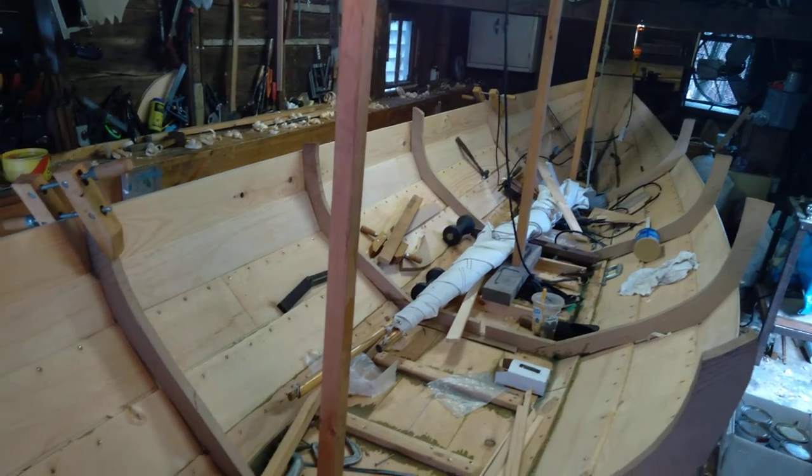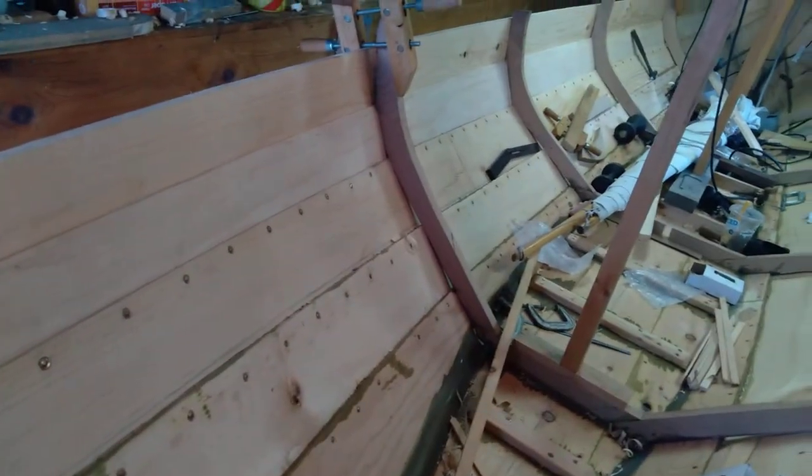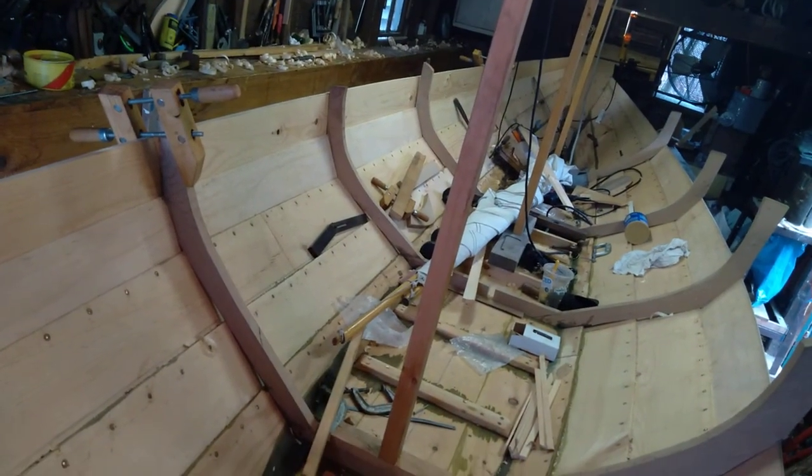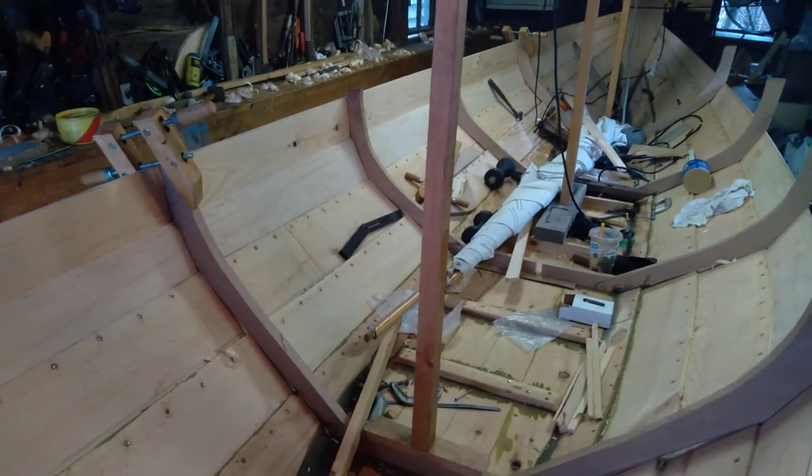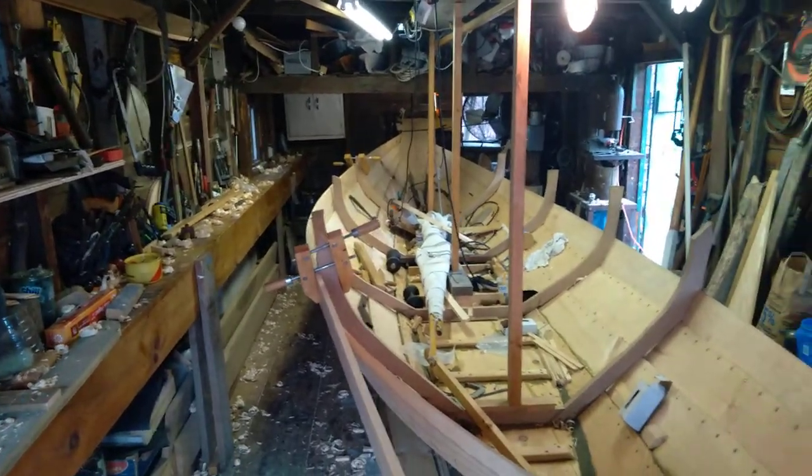You can kind of get the feel now for just what a powerful hull this is going to be. Fair amount of freeboard, so you can get her laid over with the sails up and not take water on. This final plank really adds a lot of volume to the hull. But then her shear is also low enough where if you get a couple of guys in here, you'll be able to row against most wind. Yeah, maybe not a hurricane, but pretty much anything else. So anyway, exciting, and I'll see you next episode.